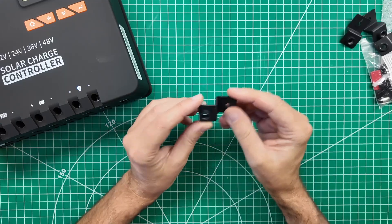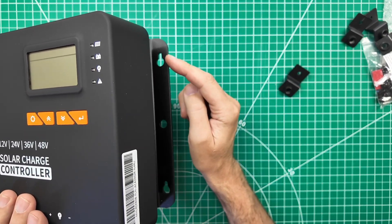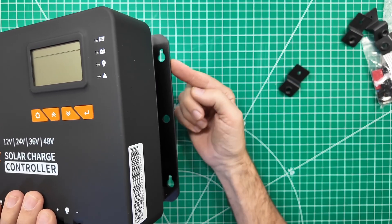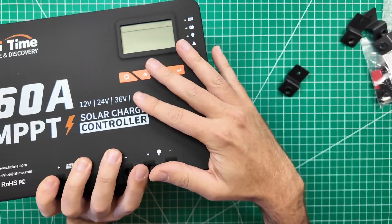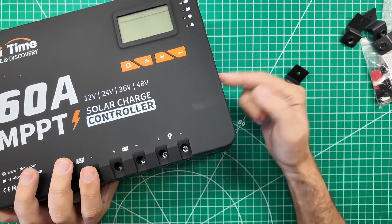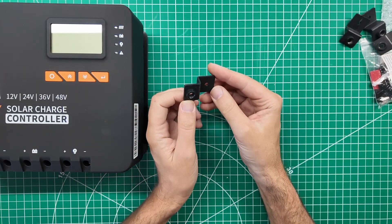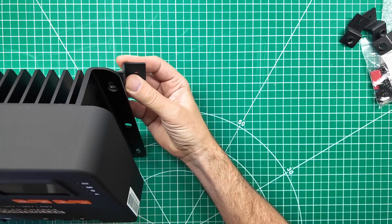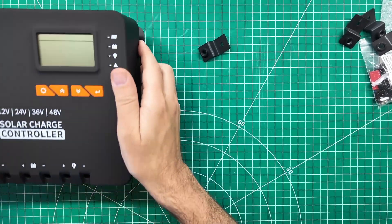These mounting brackets are actually perfect for an RV. The mounting bracket built into the backside of the charge controller has screw eyes, and going up and down the highway, this could actually bounce off and cause problems — loose electrical wires, some of which may be live from your battery or solar panel, and this heavy unit landing on something. This is probably about 10 pounds, a beefy boy. This standoff method is a much more permanent install where you can torque the bolts down for a strong hold so it's not going to fly away.